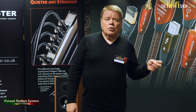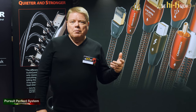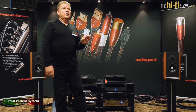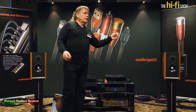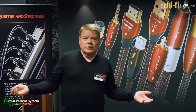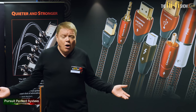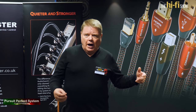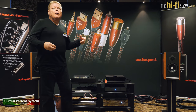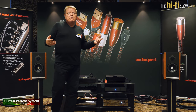And actually, it's not crazy that we started there, because to this day, if you ask an electrical engineer to measure that type of cable, it is more than capable of faithfully delivering at zero VU level, 20 hertz or even lower than that, to well in excess of 20,000 hertz. And assuming that you have reasonable damping factor and the wire isn't too long, it's capable of delivering enough current, particularly RMS, on steady state, to where your damping factor or your control of the woofer and its magnet or motor would be sufficiently good.